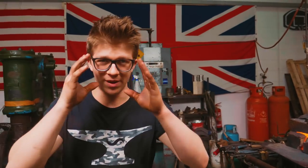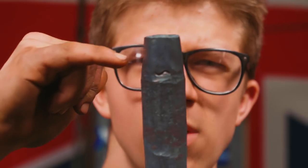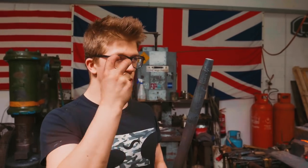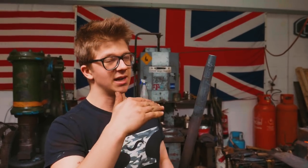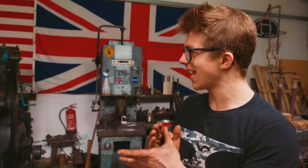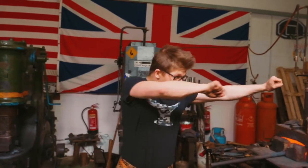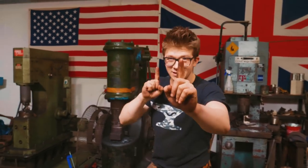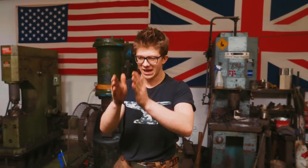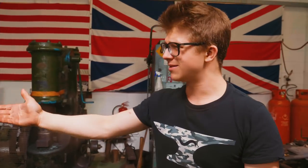So we've got this piece forged out. Right where my touch mark is will be our forged material. I've made a little shoulder there to hopefully allow us to grind it and go to a ground finish above or below the touch mark for that nice transition. Now, this is not a bar of Damascus. I had a piece of Damascus — the off-cut from when we did our fairy flip. I had it in the saw getting ready to cut it, and I said to myself: am I really about to do this with my design? Damascus blade, beautiful forged guard, forged bit, Damascus, elaborate handle — am I going to have Damascus, then Damascus again with a transition from forged to Damascus, and then maybe Damascus at the other end? I think it's just too much Damascus on the piece.